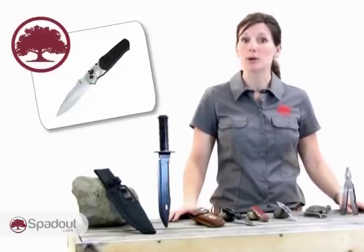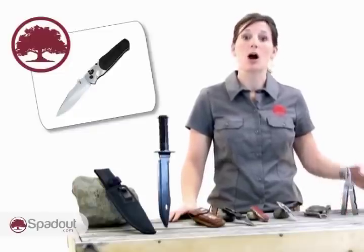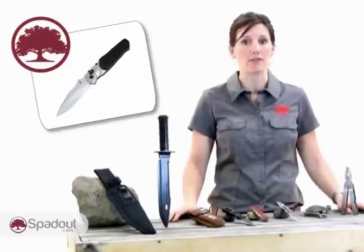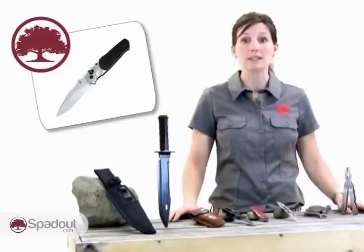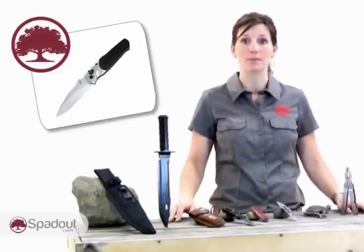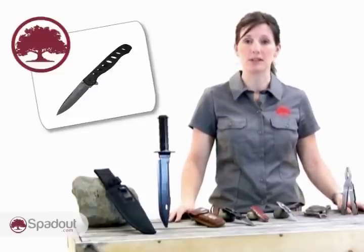Laminate blades use multiple metals to create a layered sandwich, combining the attributes of both. For example, a harder, more brittle steel may be sandwiched between an outer layer of softer, tougher stainless steel to reduce vulnerability to corrosion. In this case, however, the part most affected by corrosion, that edge, is still vulnerable. Titanium is lighter, more wear-resistant, and more flexible than steel, but unable to take as sharp an edge.